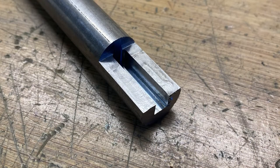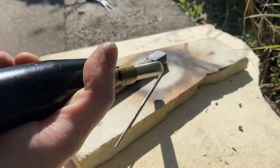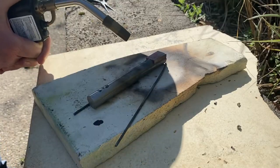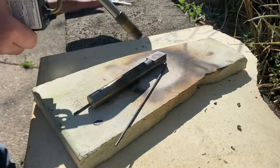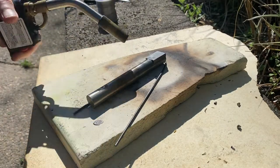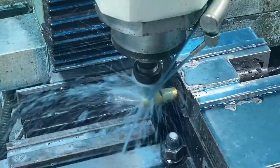First I tried to make this key out of 303 stainless. You can see me adding some flux, heating the part up, and I could not get the braze alloy — the solder — to flow. I don't know if I had it too hot, but I know there's trouble with stainless. If anyone's got suggestions I would love to see how to do it.